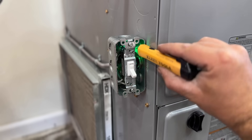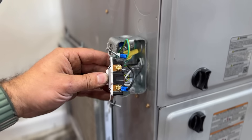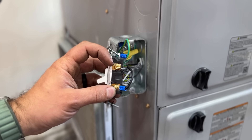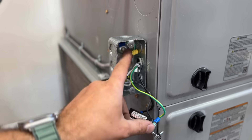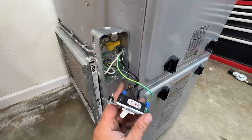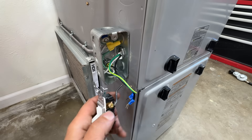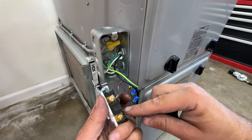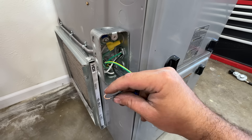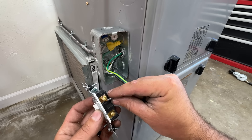We're going to confirm there's no power and go ahead and take this off. This is more than likely what you'll see when you take your switch off — your main power lead going to one part of the switch and the furnace wire going to the other side. The neutral is just wire-nutted, and we have one ground on the switch and another tapped into the box. We're going to disconnect all of the wiring to this switch. Any stranded wire will have a connector — if you just wrap it loosely that won't be a good connection. For solid wiring, loop it properly and always make sure the screw spins in the same rotation as the wire going around it.